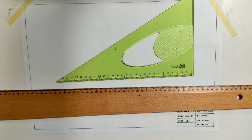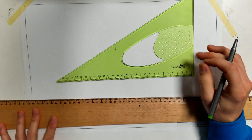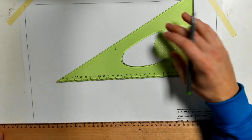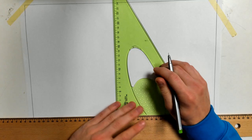Okay, so our page 170, question 1, it's a little coffee table. For our isometric drawing, we mentioned that our angle of projection is going to be 30 degrees, as opposed to our oblique drawing, which is 45 degrees. The first thing we have to do is set up what we call a crow's foot.